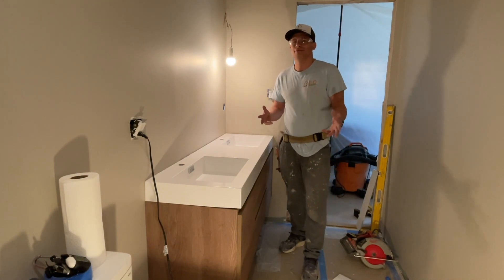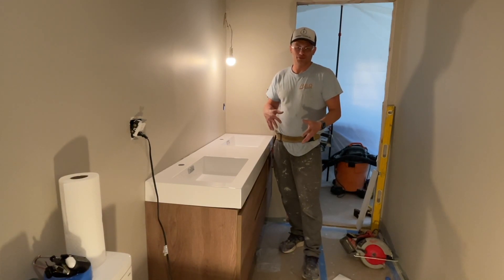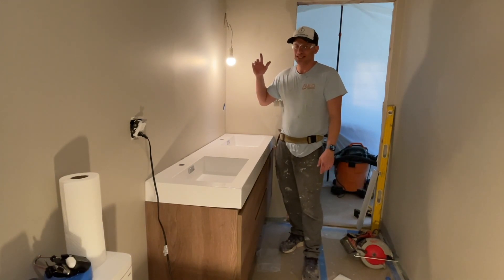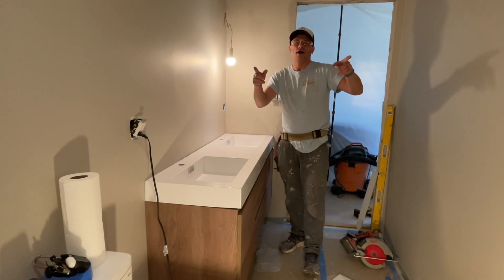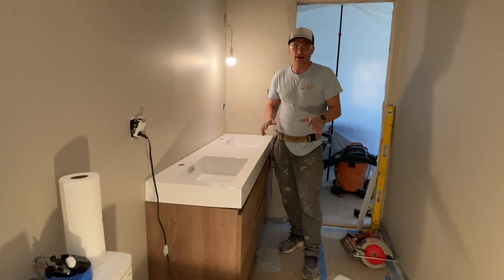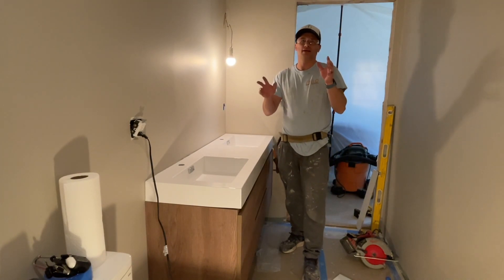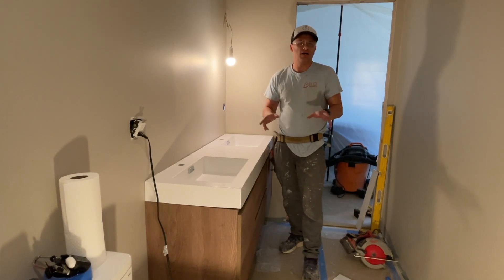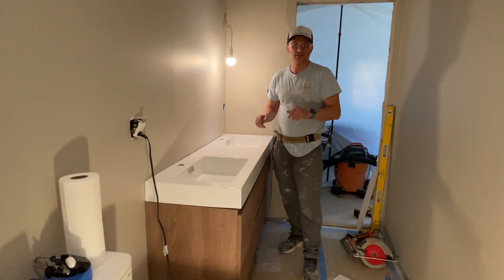So my client had a great idea, and I didn't listen to it. He told me yesterday, came in this morning, and he was like, hey, didn't I tell you that yesterday? So kudos to the client. We're going to tile this, and we're going to use the Schluter Jollies that we used on the niche and on the ends to make this look really nice. I think that's the best way to finish off something like this — do a matching tile that's in the existing bathroom, and it'll all tie in together. So let me start cutting tile, put it up as I go, and I'll show you how I do it.